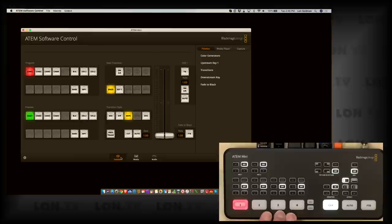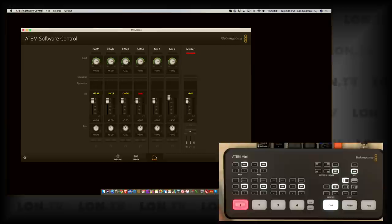On Windows you can actually touch the screen to control features of the product, which is pretty cool. Now let's jump into the audio mixer first. You can have six different audio sources mixed together — all four HDMI inputs along with those two analog mic inputs. You can see camera two is getting audio in. Just like the video switching functions, it's all synced up. I can control the levels by hitting the up and down arrows on the physical control surface while seeing a much better view of your audio situation through the software.